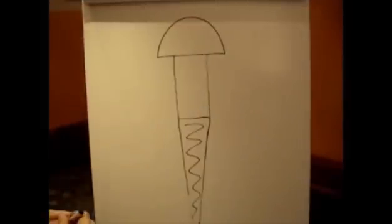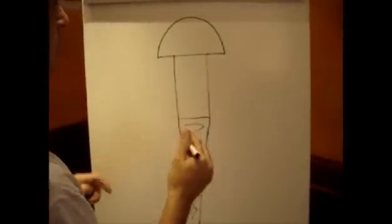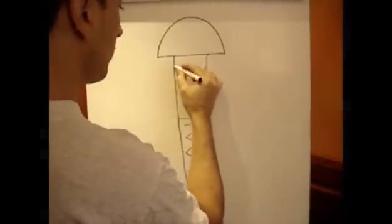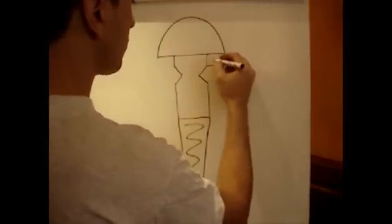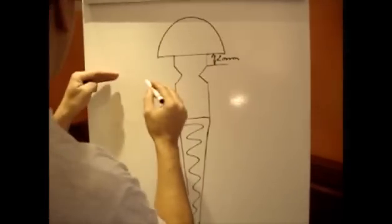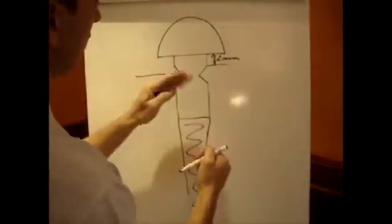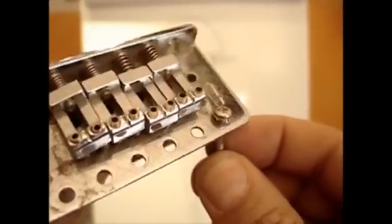So this is the side view of the screw. You just bring the screws to one of these companies who use milling machines, you know, work with iron and steel, and tell them to make a slot all around the screw that way, so that finally the screw becomes something like that here, leaving about 2 millimeters at this point. What will happen is that later, after we sharpen the bridge plate, as I showed you before, the bridge plate will enter here, creating a sort of floating razor edge floating bridge. This is the effect.